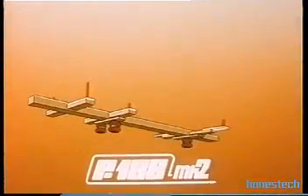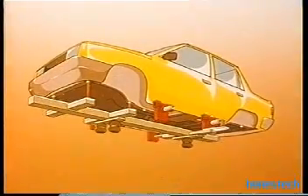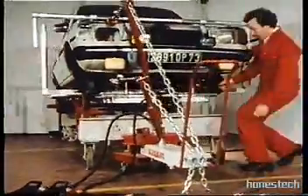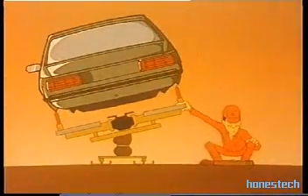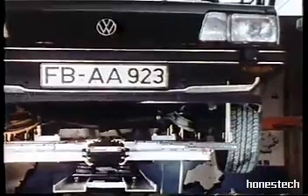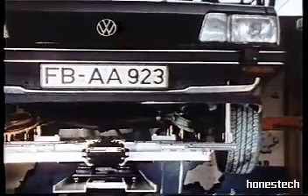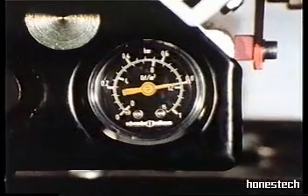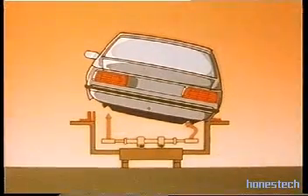Not so with the P188. It attaches itself to the underbody like glue. How the vehicle is clamped is not important. The car might move during the repair — this is not unusual in any repair system. Watch this demonstration. The P188 stays with the vehicle due to the elasticity of the air bellows. Any pressure changes on the measuring unit are controlled by internal regulators. No need to reset the air controls — a further time saver when compared to the first generation systems.